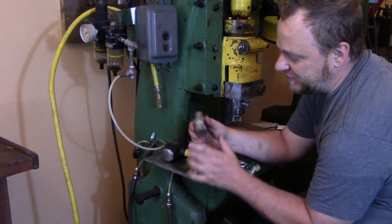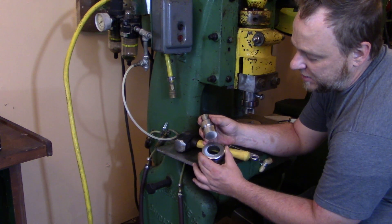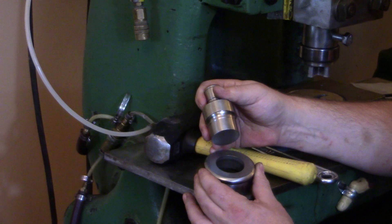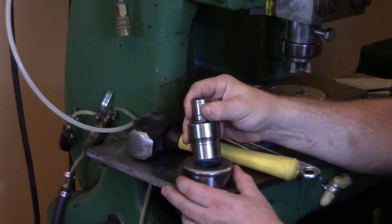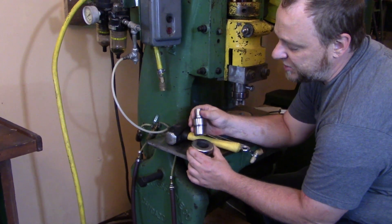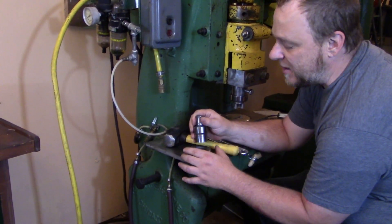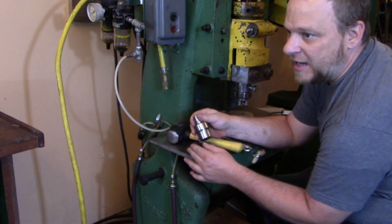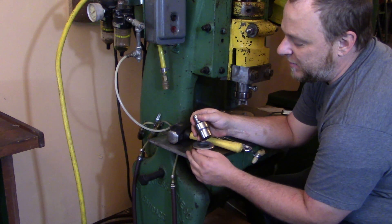Most of what we do is in circles, the setup's fairly simple. And really what you're looking at here is a punch and a die. It's quite simply just a very heavy-duty cookie cutter, if you will. This was actually invented by Leonardo da Vinci specifically for coin making. Prior to the invention of the punch and die, parts were hand cut using large shears and then adjusted using files to get the weight you need. The advent of the punch and die actually allowed for the fabrication of the exact same shape, diameter, whatever it may be, over and over in a repeatable fashion. The punch and die took over industry and to this day everybody's very familiar with the term tool and die shop — it was invented specifically for coin making.